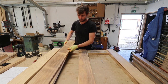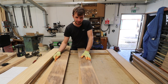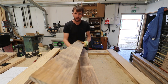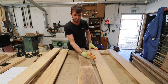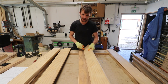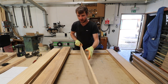If you do have imperfections - like this one here that's not quite full thickness on the end of the board - pay attention to what your door layout is. If you've got a brace running at 45 degrees through the door or middle rails, you can orientate that board so that the back edge, whether it's got a shim or a knot or something, could be placed above one of those positions. If the brace was at 45 and that was in the middle, you'd want this board somewhere in the middle of the gate so the brace will hide that imperfection. Doing these little bits of thought all the way along can make a good job a great job.